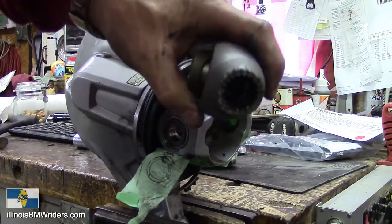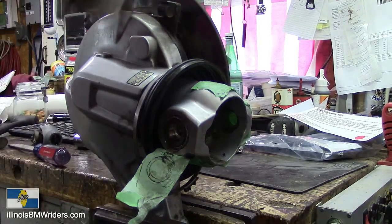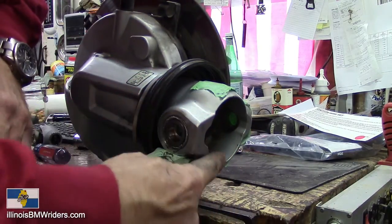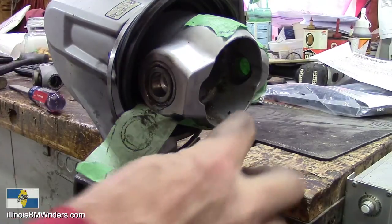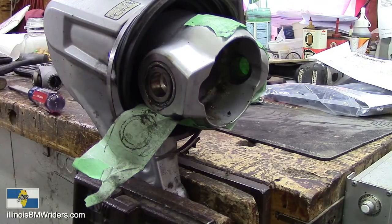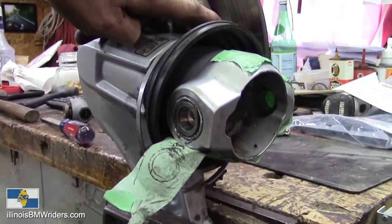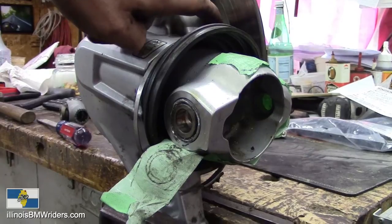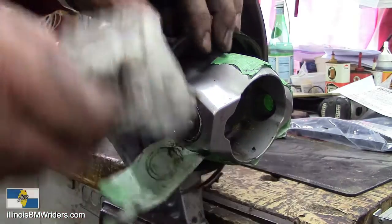The ring's still in there, so it looks okay. Now on this one here there's some oil leaking — you can kind of see it in here. On this particular unit there's some gear lube here. That's really not too big of a deal on this model. The biggest concern is the bearing up inside here, as long as this one doesn't start leaking. This one's not that much of a deal unless it really goes completely out of whack.